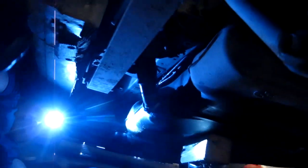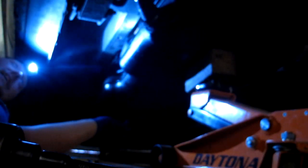Try your foot on it — see it? Yeah. Did you see it on the camera? It was definitely squirting. Since I know where the leak is and I can get to it right here, we can probably just put a fitting over it. Yeah, that's what I was thinking. It's going to be a bitch to get that line off because of where it's at — I'd have to take the whole thing down. They're all hard lines and they're rusty, so we'll just cut it and put a pressure fitting on it and hope for the best.